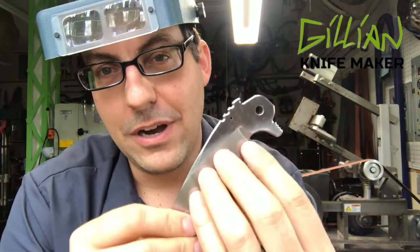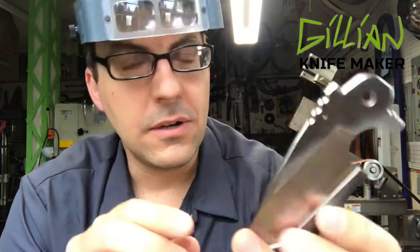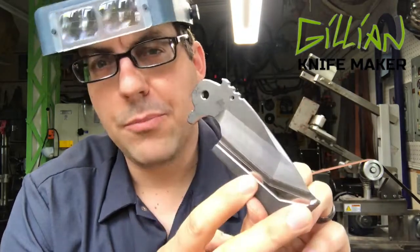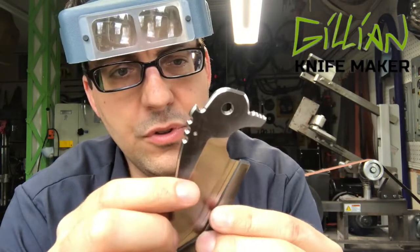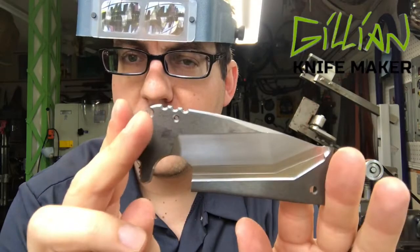In a previous video, I showed you how I milled my bevels using the Haas Vertical Machining Center. This is a symmetrical blade and we have a lot more processes to do to it. We're going to work on the step-overs — we're basically going to sand these out and try to get it more smooth. Then we're going to surface grind this piece down to its final thickness, which would be a great topic to get into mathematically.